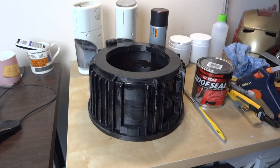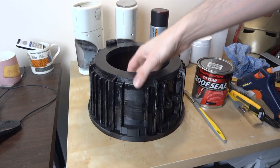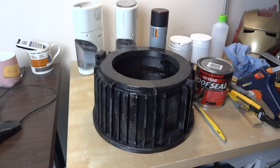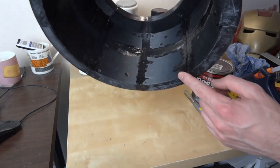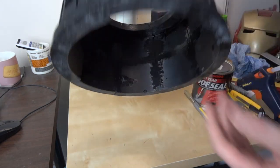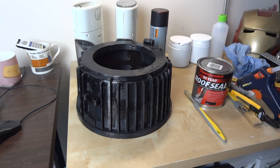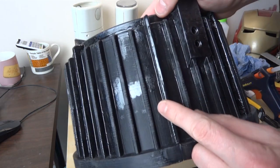Last time I showed you all the 3D printed parts being printed one by one. I've now stuck all the pieces together — I divided this into eighths and divided each eighth in half and printed them separately. Each eighth took just over 2 hours to print, so it's been quite a lot of printing. You can see all the seam lines just about in the middle all the way around, where I sealed it together by dissolving some ABS into acetone to make an ABS paste or glue.